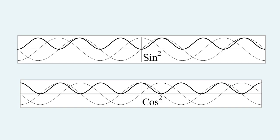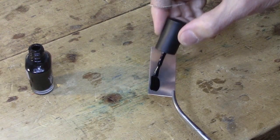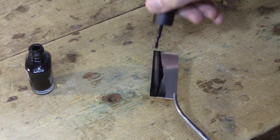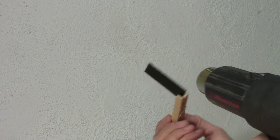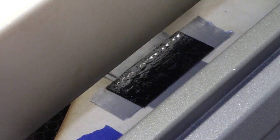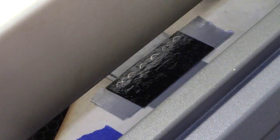Their lengths are calculated by multiplying the desired finger diameter by pi. I'll start with a piece of sheet silver and paint it with some black nail polish — that's a kind of lacquer that can protect the silver from being etched. We'll let that dry, give it a second coat so it's well protected, and dry it again. Now I've set up a little jig in this laser cutter to position it repeatedly. We'll burn away the nail polish to leave the metal exposed where we want to etch the curves, axes, and text.